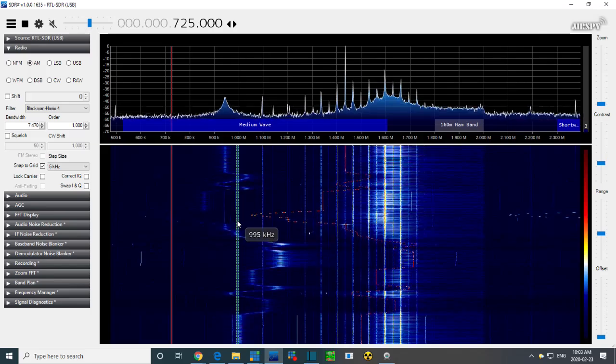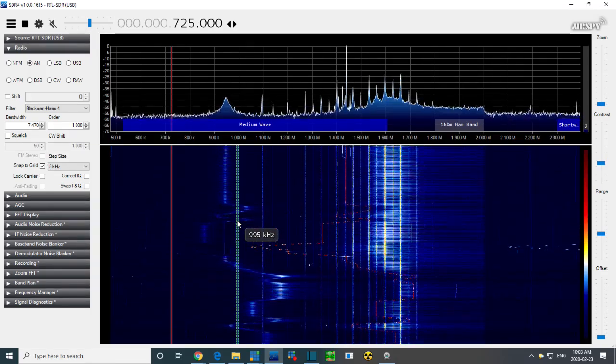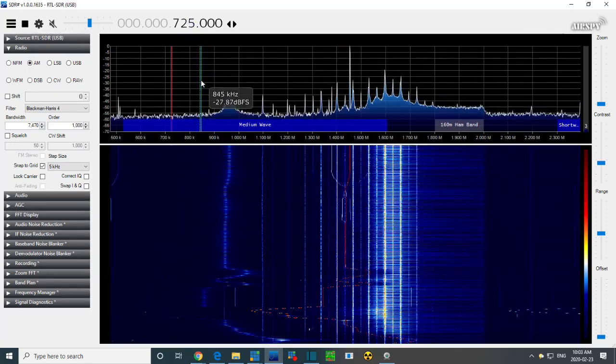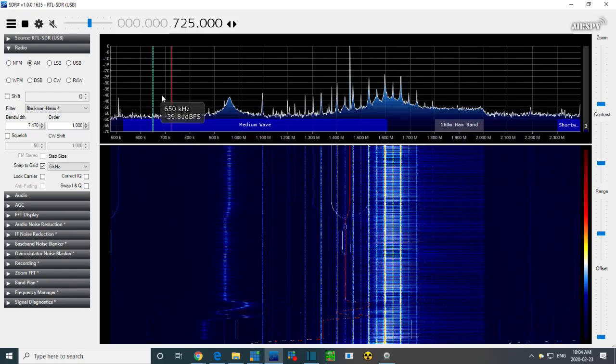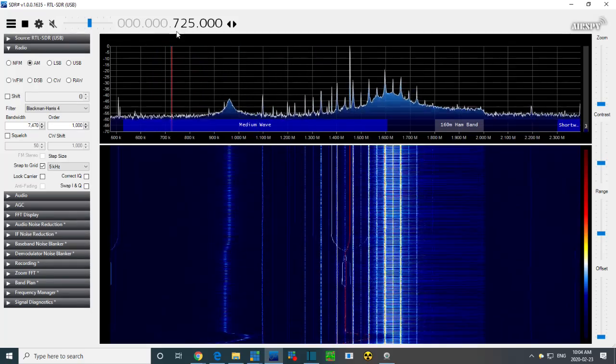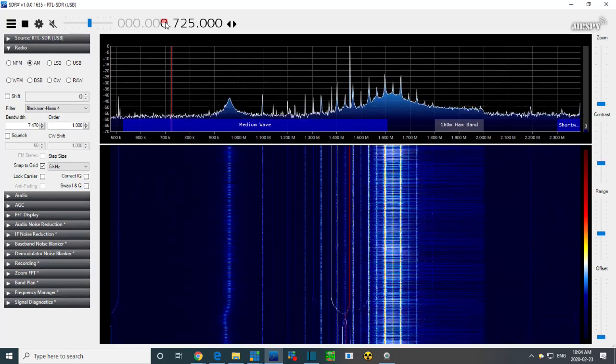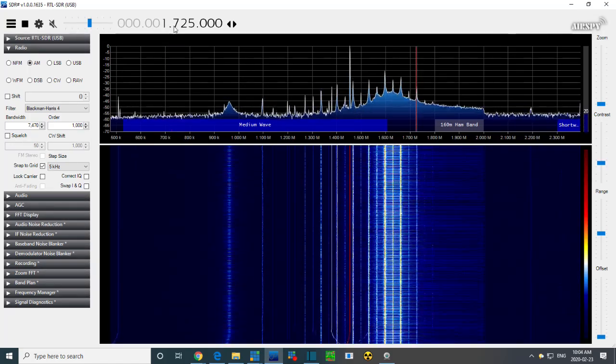So let's set the local oscillator to 1 million plus 455. So that'd be 1455. To make it easy, this is the SDR's tuning red line here. I'll move this to exactly where we want it to go. What did I say? It would have been 1 million plus 1455. So we want to put, oh, it's right on. How did that happen? That's just a funny coincidence.